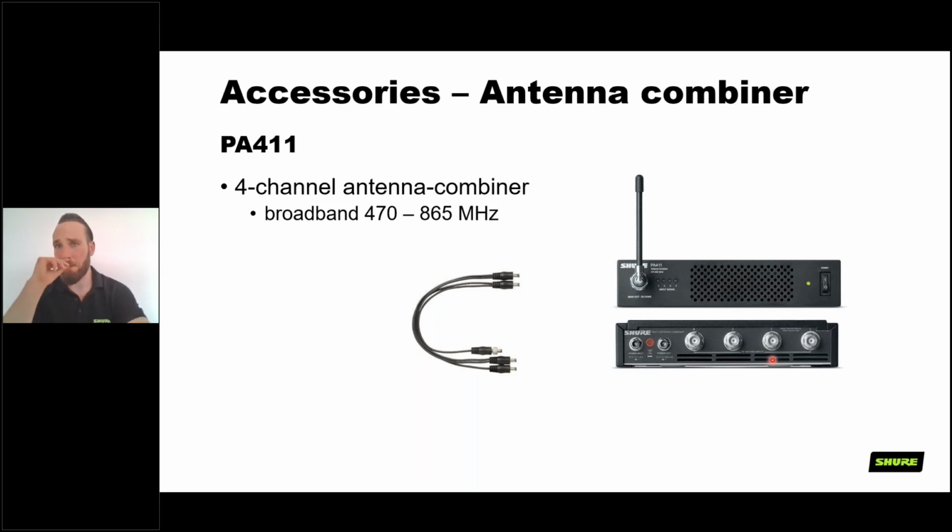And of course, if you have it in your rack systems, usually what happens is if you use different antennas, they take away energy, thus producing intermodulations. And to simplify this, this is something that can definitely interrupt or produce dropouts, and you don't want that. So if you use more than 3 transmitters, please use a combiner. A handy thing is that with these cables, you don't need the power supplies for each and every transmitter, because this combiner can feed all 4 transmitters.